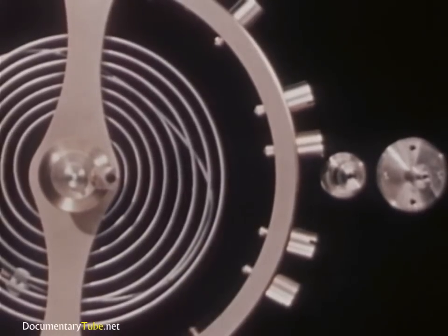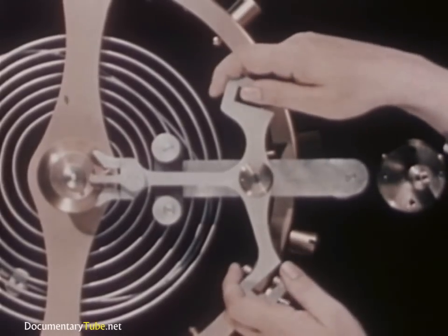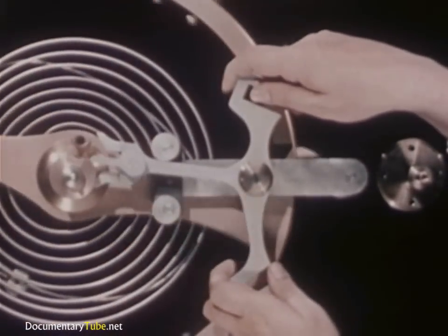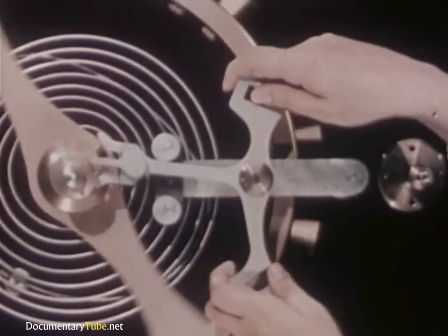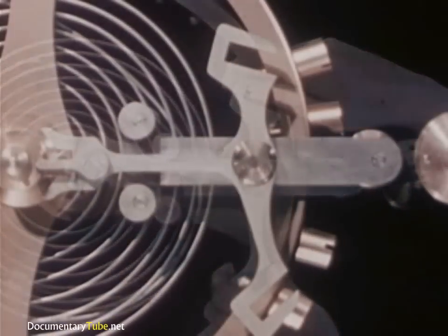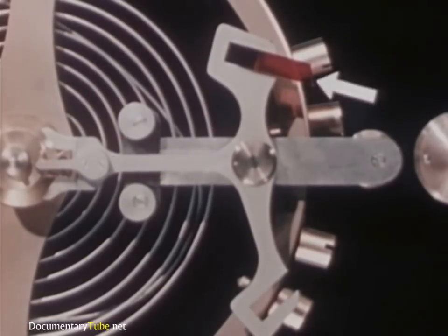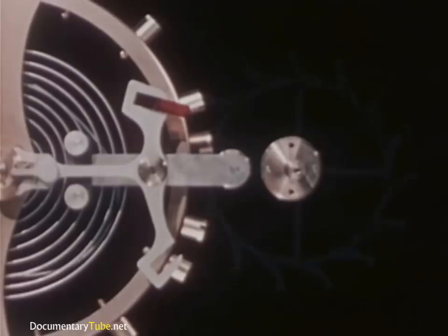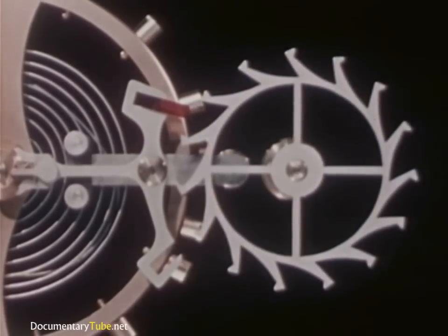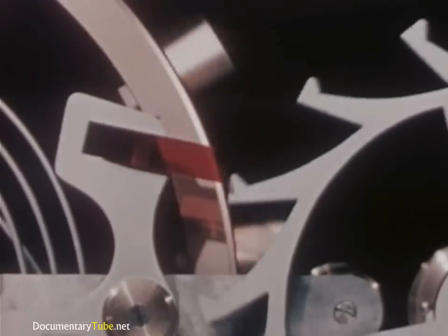To do this job of pushing, we need this odd anchor-shaped lever called a pallet. It can be mounted so that when we move the pallet back and forth, we can apply a series of impulses to the jewel pin to keep the balance wheel in motion. Now to the pallet cross arm, we add a pallet jewel shaped like this. Here is a wheel called an escape wheel with teeth on it so shaped that they will push the pallet jewel and jog the balance wheel into motion.